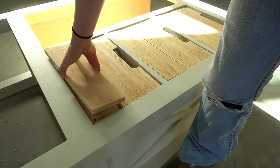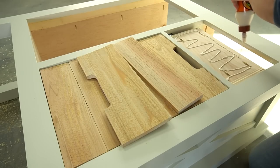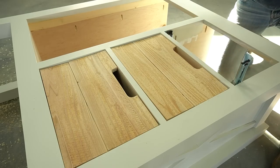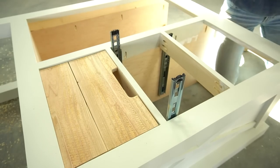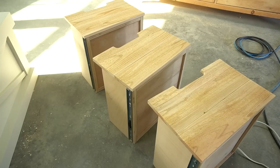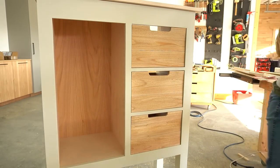These are pretty rough, so be sure to sand them well. I went over mine quickly with just 100 grit sandpaper to clean them up, but I didn't sand so much that I smoothed them completely out — I still wanted some of the rough texture. Then I glued the pieces onto the front of the drawer boxes. I didn't have the right length brad nails, so I carefully placed the pieces, then removed the drawer box trying really hard not to move the pieces of the front. I set these aside so they could dry, then went to the store and got the right brad nails and came back later just to add some for extra security. I really recommend having the right nails before starting the gluing process. Once the glue had dried I put the drawers back in and nailed the fronts in several places.